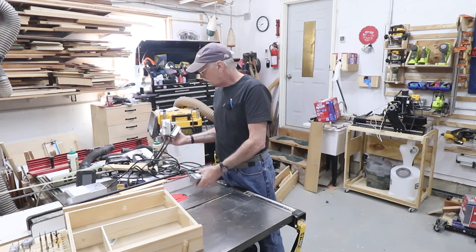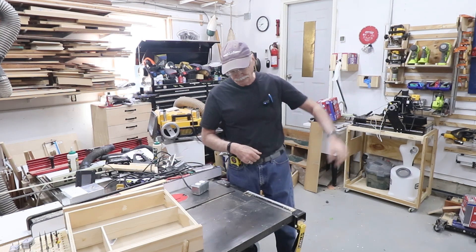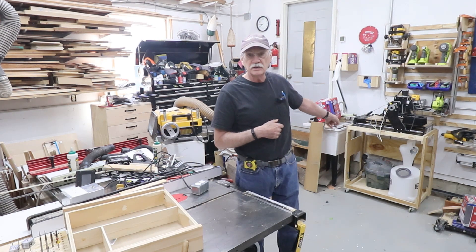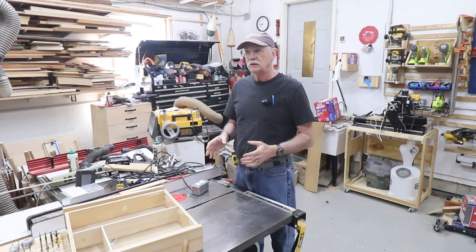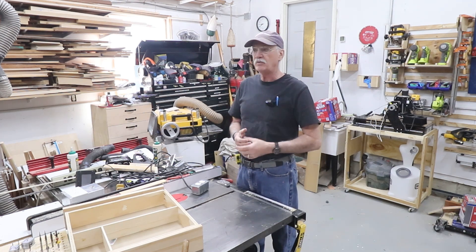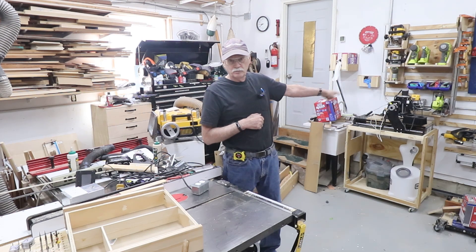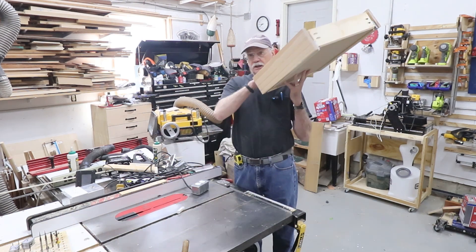This plug will probably go away, and this is the box with the switch. Basically what's going to happen is there's going to be a power cord going to the wall, it'll come into a box with a switch on it. One leg will go directly to the dust collector — which will be on all the time and activated by the switch from the computer — but if I throw the switch the other way it will turn on the dust collector shop vac so we can run hose anywhere in the shop. I've ordered the hose kit and will do an unboxing when it gets in. Now I have the wonderful task of going over to the CNC, removing the CNC from the top, flipping the table upside down, and putting the drawer assembly in place.